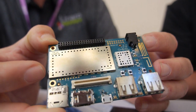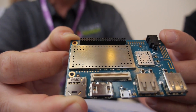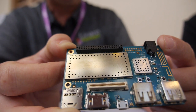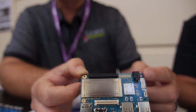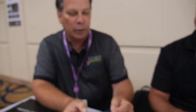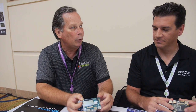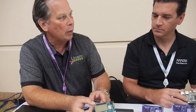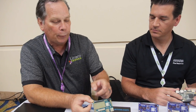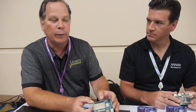Part of the CE spec is that this power supply looks like a normal power supply, but it's not. For folks who never quite know what they're going to grab out of the toolkit to power the board up, this thing works from 6 volts to 18 volts — just plug it in and the board will power up. There's enough capacity on this board that I actually use a 12-volt supply to drive 5-volt relays and 12-volt motors through the board, letting the on-board power supply deal with it.